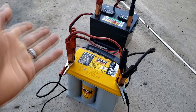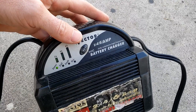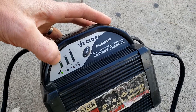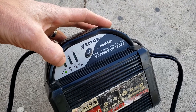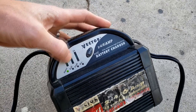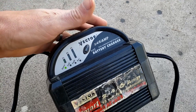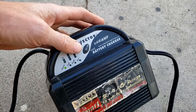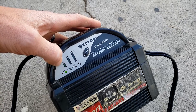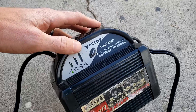Always charge your battery with a low amperage — a two-amp trickle charge is the safest method and it'll make your battery last longer. If you charge with a high amperage they tend to charge fast, yes, but they don't really last as long. Since these are connected in parallel, two amps is a good setting.